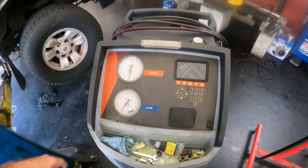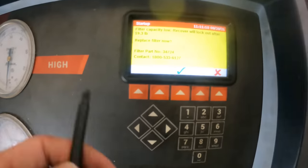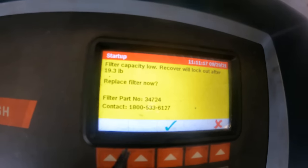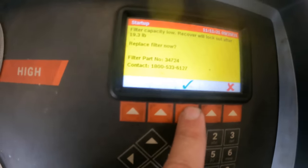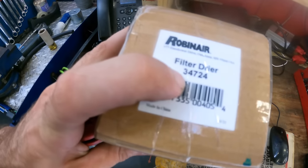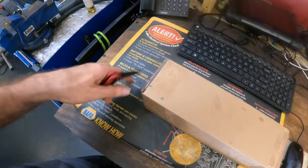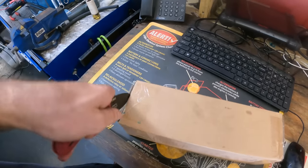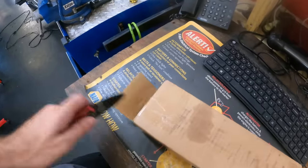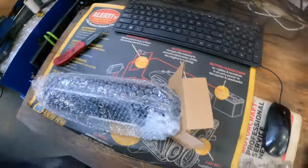We need to do a little bit of maintenance to the Robin Air AC recovery machine. As soon as the machine starts up it's saying it's going to lock itself out in the near future — it wants to replace the filter, gives me a part number. We're going to change this filter today. I got the new one here, it's a Robin Air branded filter dryer. We're going to open it up, grab the serial number, program that into the machine, take the covers off, and replace it — because if we don't and it goes into lockout mode we'll have to call a service technician out.